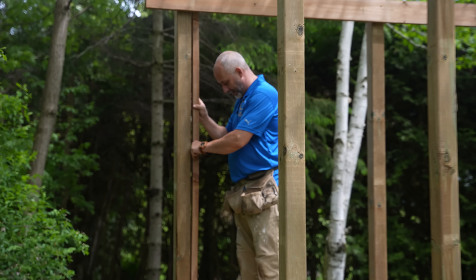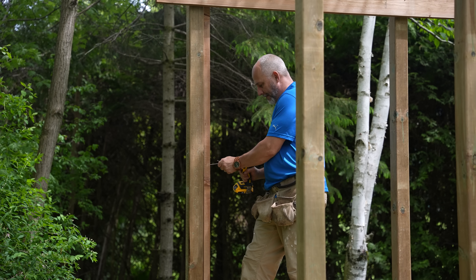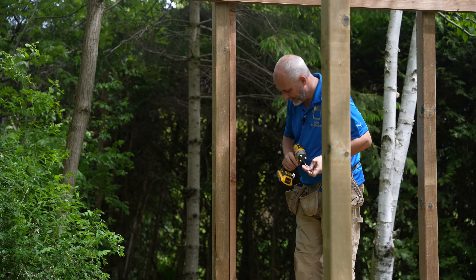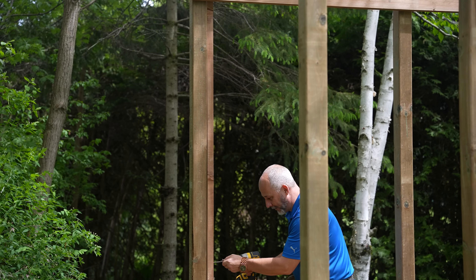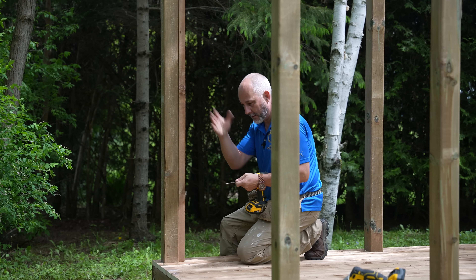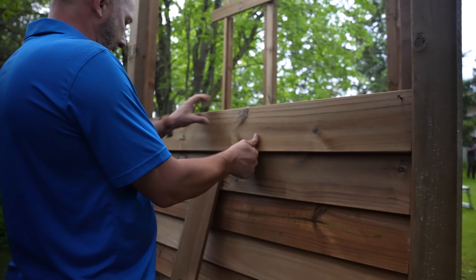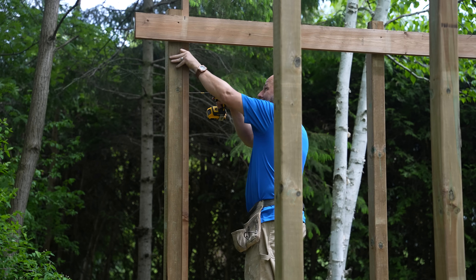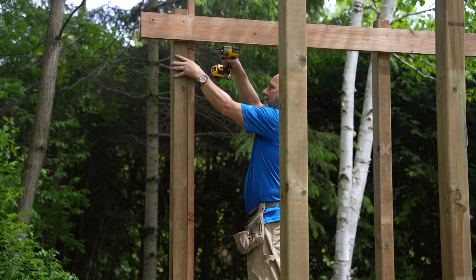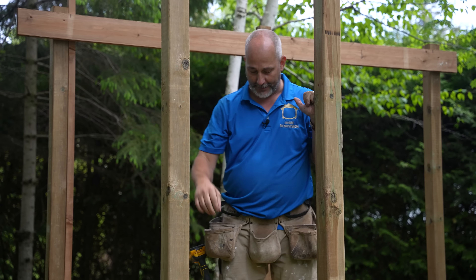Here's the system — I'll try to explain it the best I can. I'm going to be using 2x2s as a nailing strip for fence boards. It's a very rustic look but really effective because it diverts water well, using overlapping fence boards — kind of looks like an old cedar shaker house. The benefit is these materials are always available and always in stock, so you never have to plan too far ahead, except for the roof.